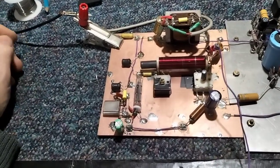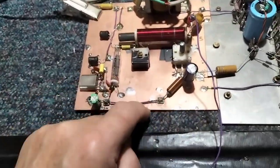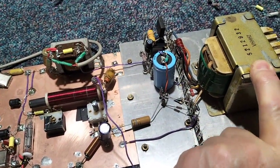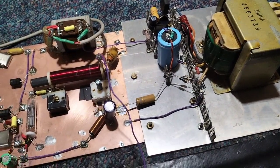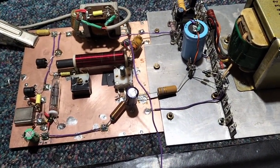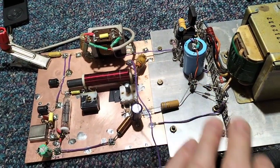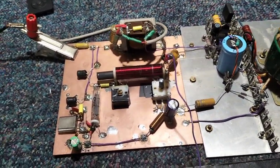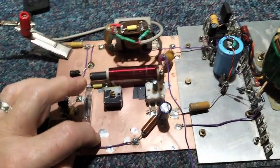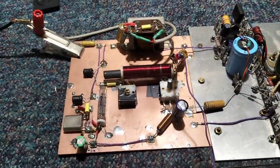But then I decided to try the 1P24B, which is the power one. We've done away with the regulator, because the secondary of this transformer and these little chokes don't give it enough headroom between the regulator and the valve. So we've just done it with a simple dropper resistor. I've got 1.15 volts or so on the filament. But it would not work very well at all on G3 drive — very, very weak signals indeed.